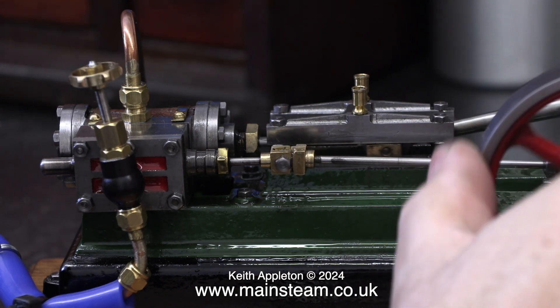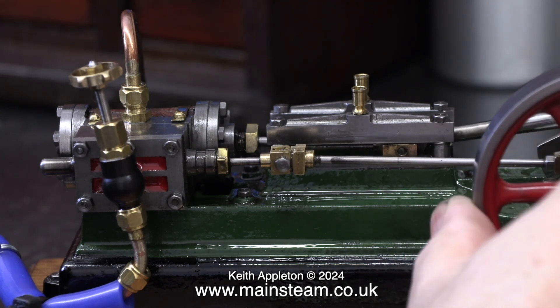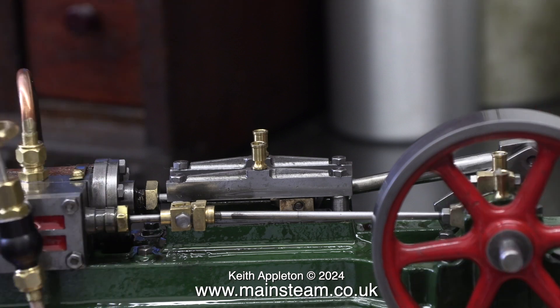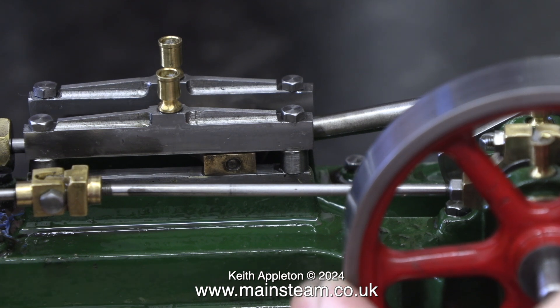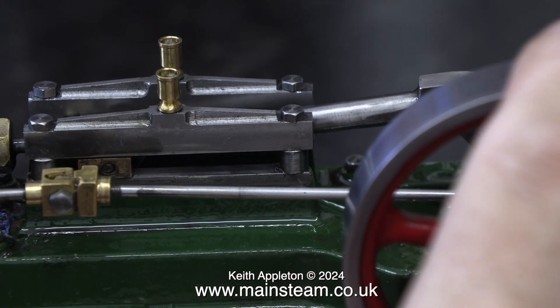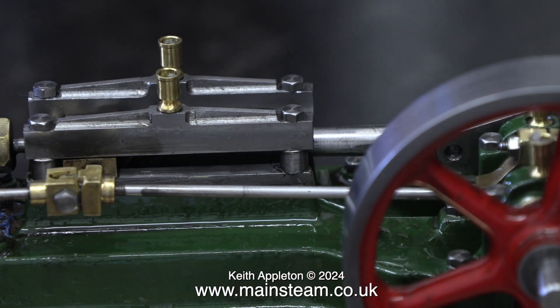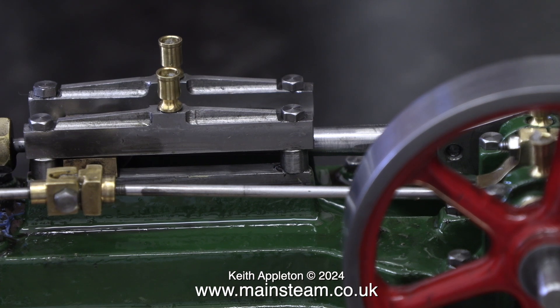We don't have the action man in the shot. I think you've done very well with this one. You've asked me about marks out of ten — I would say seven to eight out of ten on this one. There are one or two slight anomalies that puzzle me, particularly with the quality of machinery you've got and the experience. There is a bit of play on the crosshead — you can see the crosshead moves up and down at that point, but it doesn't move up and down at that point. Which means that that spacer is less than that spacer — that isn't flat. It's a very minor point, but that would be something that I would approach.